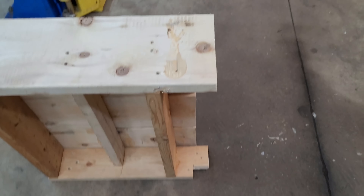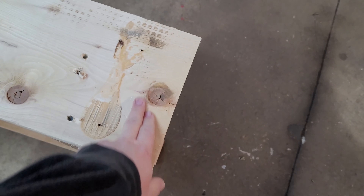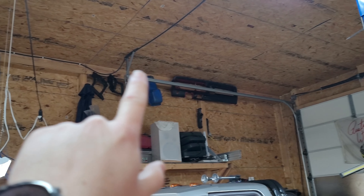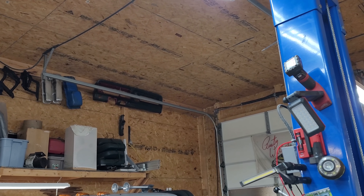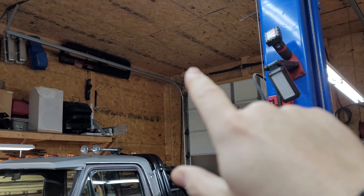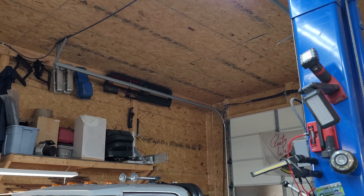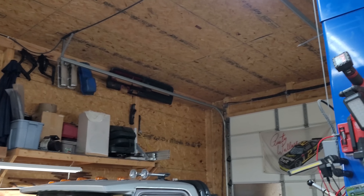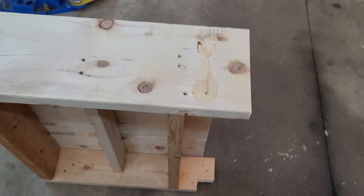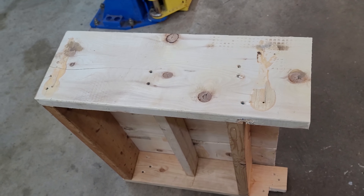This part is going to be hanging out in open air. I haven't figured it out yet but I'm going to run some sort of stainless steel cable. I haven't figured out how I'm going to hook it to this — up to the main beam that runs the whole length of the building that supports the whole top of the trusses. It's probably the strongest part of the building. I'm going to put a big eye bolt up there, and that's what I'm going to use to winch the compressor up there. Once the compressor is up, I'm also going to have a cable with a turnbuckle so I can adjust the tension, and that's what's going to hold the corner up.